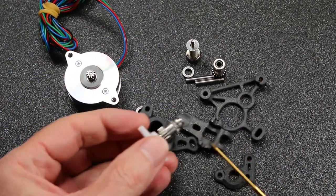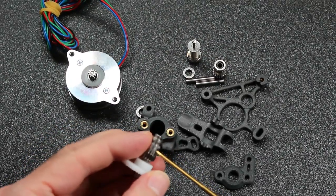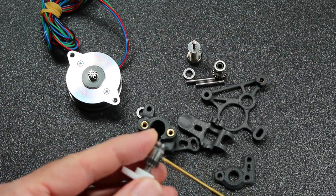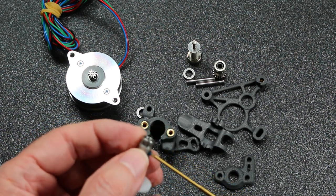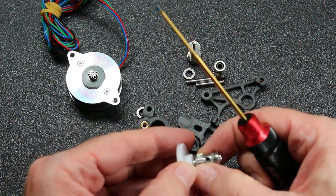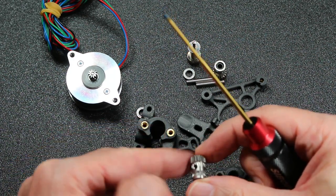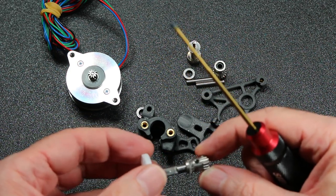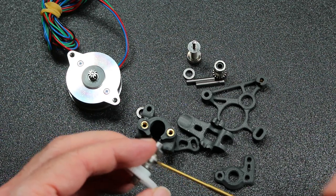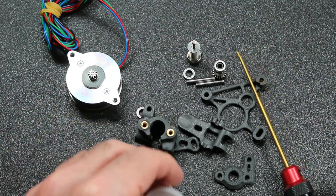On the gear, you're going to have to flip this around and then push it in closer to the plastic that is the gear. We're doing this to make the filament holding area of this extruder gear line up with the hole in the body of the Sherpa Micro. And once you look at it up close, it'll be obvious as to why we're doing this.